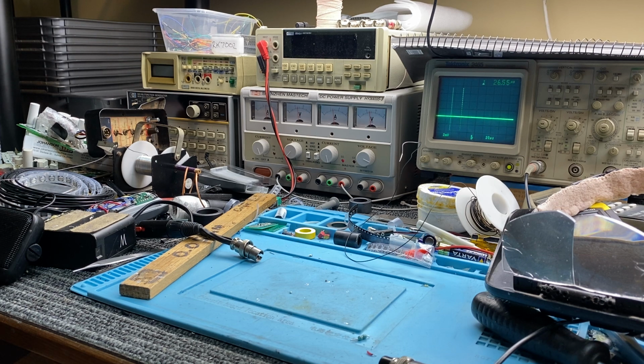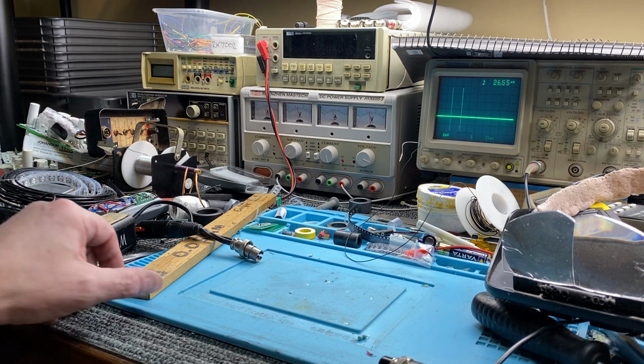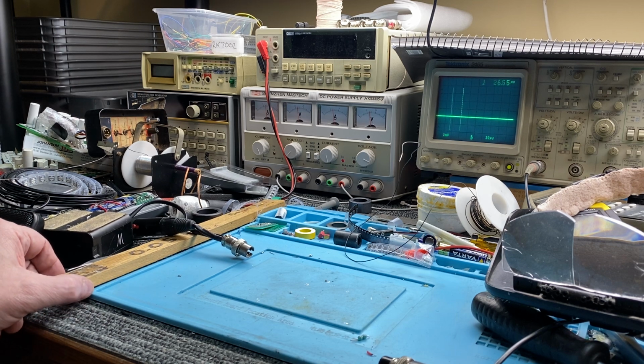If it smells like vinegar, don't use it, because vinegar's an acid. It'll attack the board and stuff it. It'll eat the tracks through. Given enough time, all you're going to have is vinegar in there. Even if it dries out, a little bit of moisture, even in the atmosphere, you'll start chewing it out again. I'm well aware of the effects of acetic type silicons.